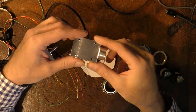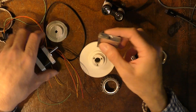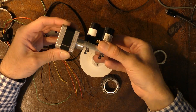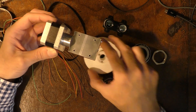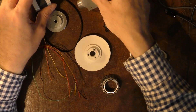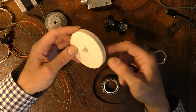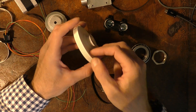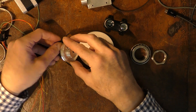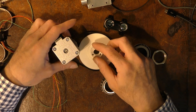You've just watched me make this, which is a bracket to hold this Garmin laser range finding module. The plan is to take a stepper motor so that I can tilt the laser range finding module, and then to use this gear so that I can spin the whole apparatus round. This is going to go down here — it's a gear that I ran off on my 3D printer and I've put a GT2 tooth profile on it so I can use this timing belt. The second gear that I've bought goes down here and then a second stepper motor goes here which can spin this.